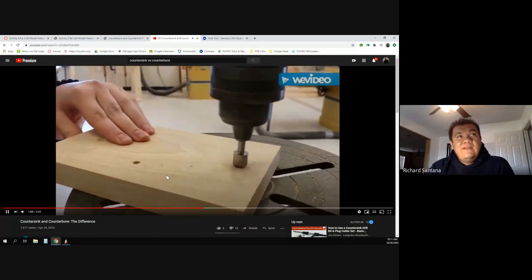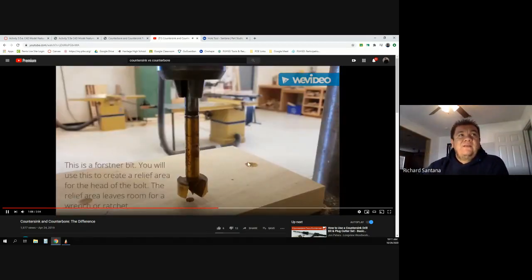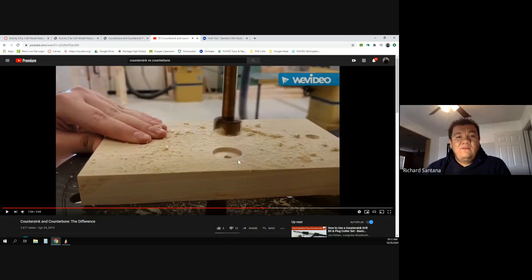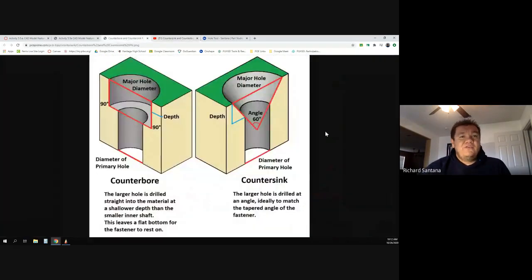Once he does that, he's able to shave off the inside so it looks like a sink — like a bathroom sink at an angle so the water funnels down. That's the countersink. The next hole is the counterbore — once again he makes the little hole first, uses that hole to sink down the counterbore. Little hole first punching all the way through, then the big one — that's the rule regardless of the type.